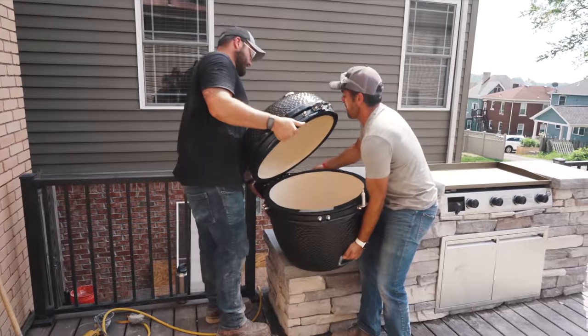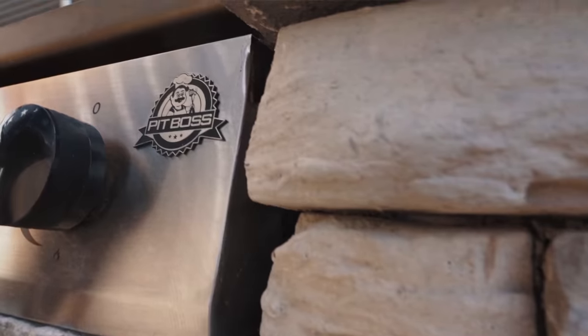This should be a little similar to the one I put on my deck last year, with a couple of different tweaks. First things first, we're going to be using metal studs instead of pressure-treated 2x4s. They should be a little bit faster and they're definitely fireproof — for all you complainers who thought my last one would catch on fire. By the way, it still hasn't. We're going to do concrete countertops in place as well as a stone veneer on the front and potentially a custom door.